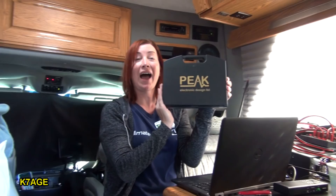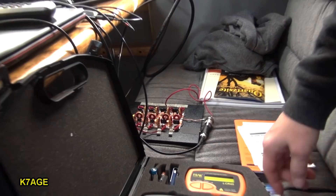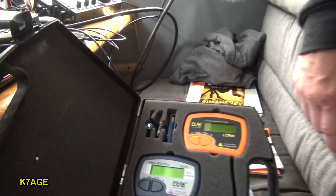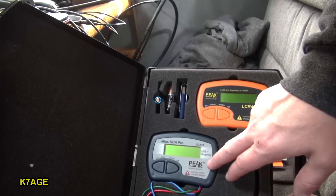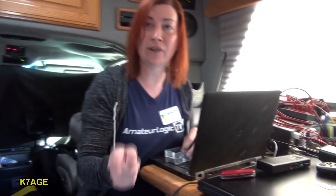So what is that? I love these. I got this because I was winding these guys and I wanted to make sure I could figure things out. What we have here is an LCR meter - this thing is fantastic. And then we also have down here the transistor checker. That thing is amazing - it can determine whether it's a transistor, a regulator, an SCR, a triac.